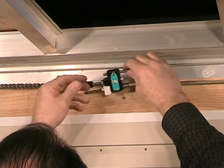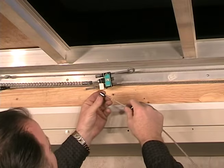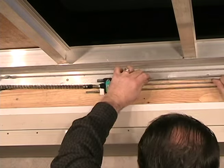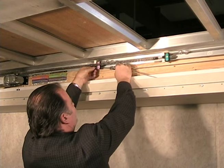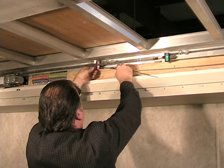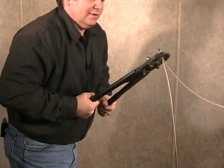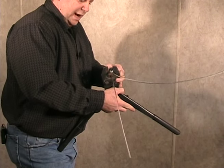Place the eye bolt in the bracket. Start the nut as in the process with the cable present. Take the ferrule, put it over the cable, through the eye bolt, and back to the ferrule. Take all the slack out of it, pull it tight, and you're ready to crimp it off. It's best, if you have the space, to remove the nut and bring the cable down to crimp it off because it may be simpler for your access. Take the crimper and crimp off your ferrule. 5/32-inch cable requires three crimps to maintain the strength of the cable itself. If you're using a multi-crimper, make sure you use the right slot or it will not crimp completely.